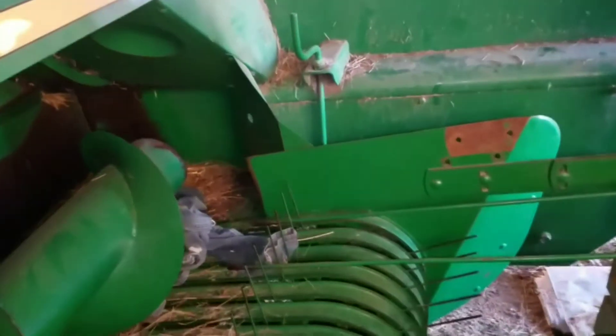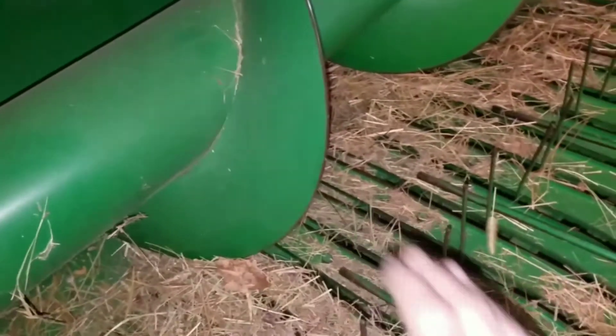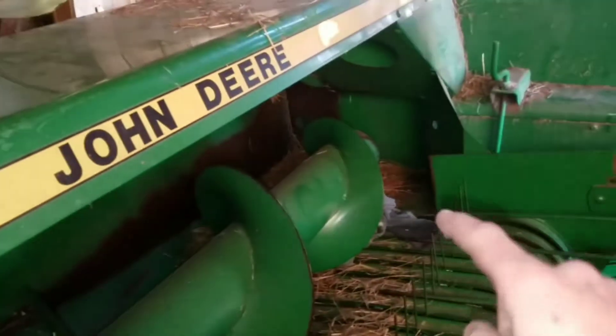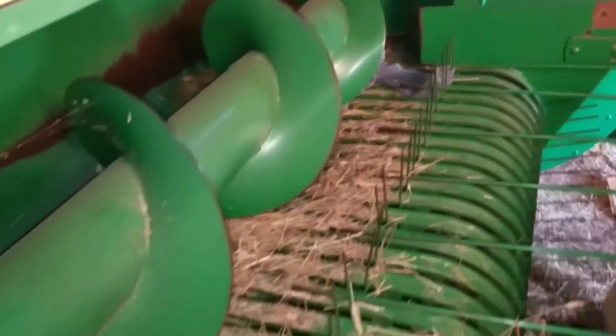I'm going to get around the other side and show you the pickup more. Right here's the pickup — that crank right there, you turn it down until this pickup's just barely touching the ground so it picks the windrow up, along with sticks and dirt. As this pickup runs a windrow, it augers it over to the stuffer fork. You can see the plunger's almost in the complete forward position. As soon as that plunger goes back, the stuffer fork goes and feeds hay right in there. The plunger's closing the hole up right now. It'll take the hay the auger's feeding — it's called the stuffer fork for a reason, it stuffs it in the bale chamber. And as it forms a square, it's got knives on the edge of the plunger that cut it into the square shape.